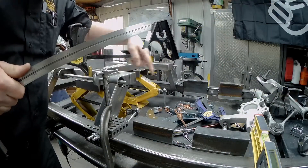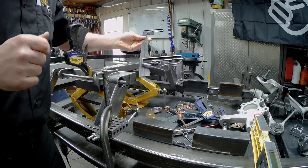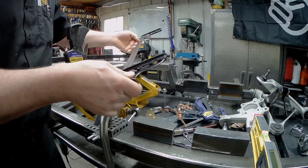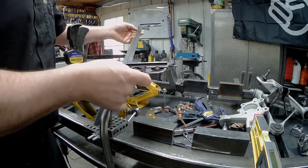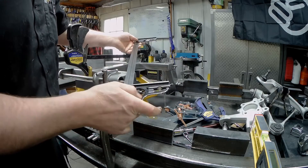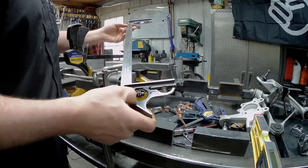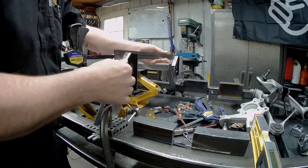We're going to look at how we get these two points measured. I've got a couple of the Starrett combination squares. If you don't have a really good combination square set, go and buy yourself one — they're expensive, but I seem to be able to pick these up on eBay for not too bad a price. I prefer the hardened, forged ones. I've also got a good long 24-inch blade.